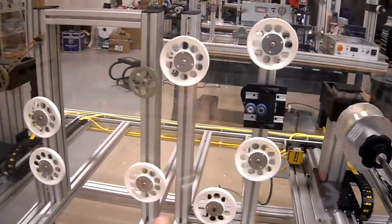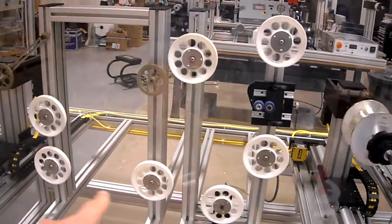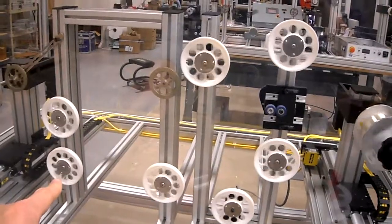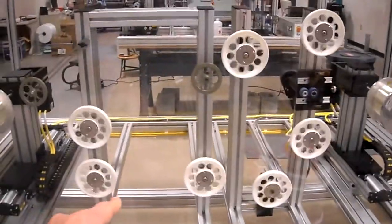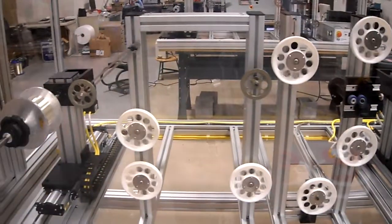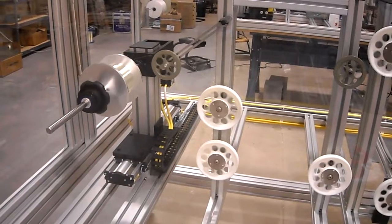In this case we also have what we call a work stretch, where a device will be inserted between these two guide pulleys for doing an inspection. We then go up and over onto our take-up spool, which is carried by its own servo traversing unit.